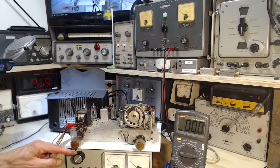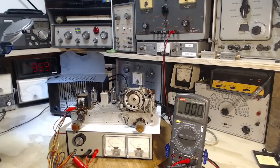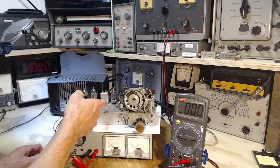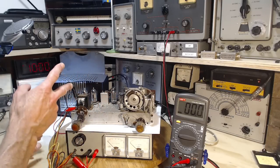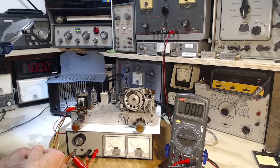Can't turn this down any lower. When I hit the switch, the ammeter here should hardly react, if at all. Let's see, is that right? These are probably, I don't know, 250 milliamp tubes. 150. I think these are 150 milliamp tubes. One, two, three, four of them, plus a 3V4 is actually two. So it's actually five. 550s. Wow, that's like half an amp. Really?